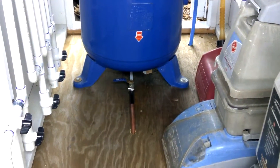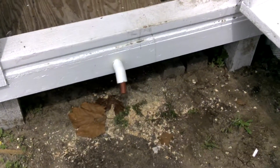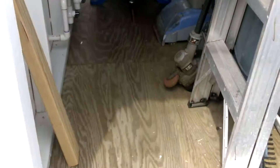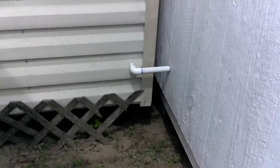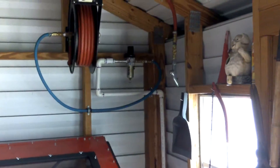There's the water release right there — I just drilled a hole into the floor and ran it out the end so I can see what's coming out of it as I'm opening the valve. I do that first, and then I do the water trap valves when it goes out of the air compressor shed into my shop. I still need to caulk around those holes, and then it comes in and goes up into my regulator.